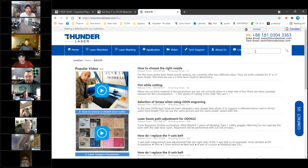It does look really cool though. You can take that HR head and do some really cool engravings on razor blades, then build them up — we've done a couple for warehouse people retiring. They're always going through razor blades, so we've done retirement razor blades as gifts. They come out looking pretty cool. The problem with these compound lenses is the focus is so tight you can only be a couple of millimeters away from the material — you can't have a big nozzle on there, that's why they're so flat and low profile. Because of the focal distance, the debris that collects on the bottom of those HR housings is a concern.